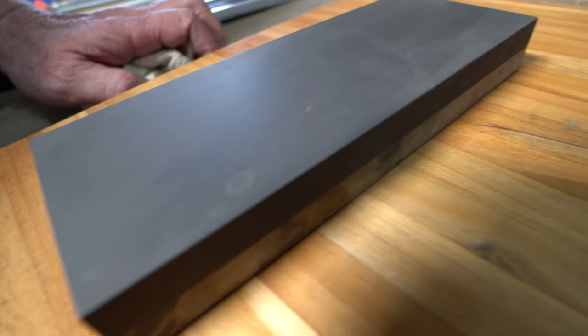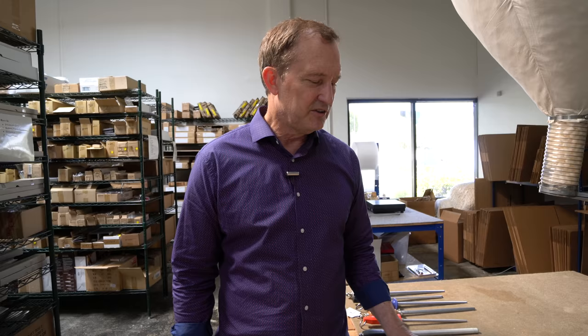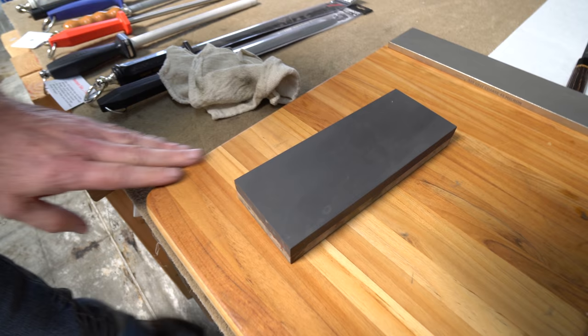More commonly, they sell stones with a honeycomb pattern — called an interrupted diamond stone. The downside is you've got about 40% of the surface covered with diamonds, the rest is holes — it saves them money but isn't ideal for longevity. Natural Arkansas stones come from Arkansas, dynamited from the earth. They range from soft Arkansas, hard Arkansas, to surgical black Arkansas — extremely smooth. There's even a translucent variety, which tends to break during dynamiting so there's not much available. The surgical black was named because it was actually used for surgical tools — extremely fine, great for polishing, but for my purposes they don't cut fast enough to have pragmatic value.